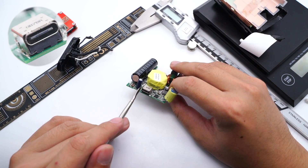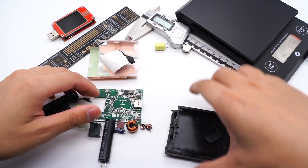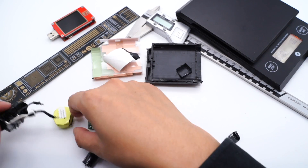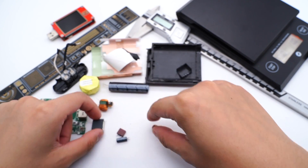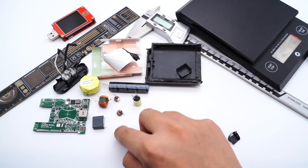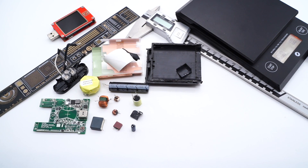Finally, the durable USB-C receptacle is protected by a steel plate. That covers all the components of this Dell 60W GaN charger. The detachable cable design is the most attractive feature, making this charger more like a phone charger than a laptop charger, and you can choose any USB-C cable you'd like. It also integrates two Navitas GaN ICs, which can effectively reduce the size.